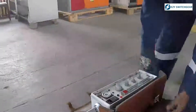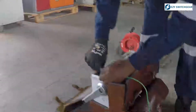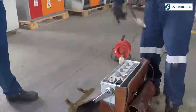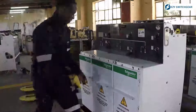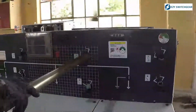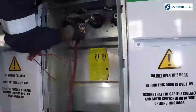The first test I want to speak about is the high pot, or high voltage test. This is a test at twice the nominal operating voltage of the switchgear — which means if you have 11 kV switchgear, you want to put it to 22 kV or even higher. We use 25 kV because we feel that voltage is safe, and therefore each switchgear that passes that high voltage test, you know it will surely work on the network.